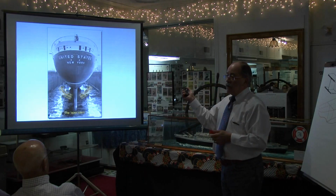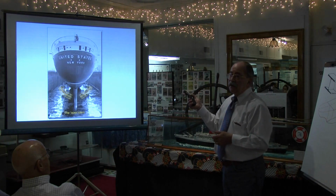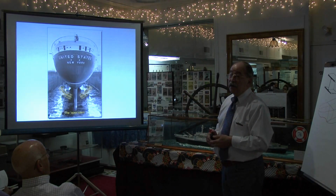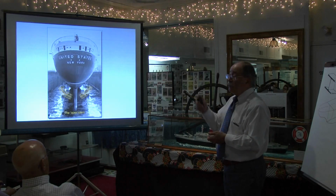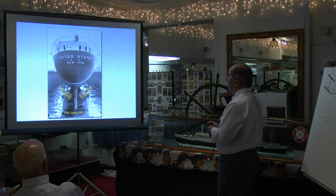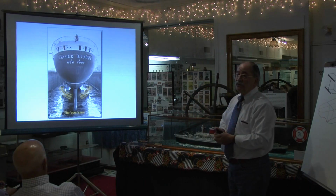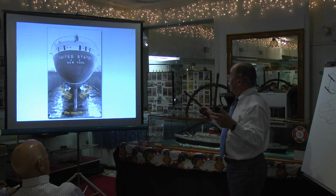And the underwater hull shape was researched over and over again on paper, by using wax models and towing them through a tank to see what the resistance was going to be and what the delivery to the propellers was, to get the maximum use of the power induced to these propellers. Now you can see the yellow lines that I've indicated. It's a very clear, open stern section to the ship, but there's lots of ability to bite that water.